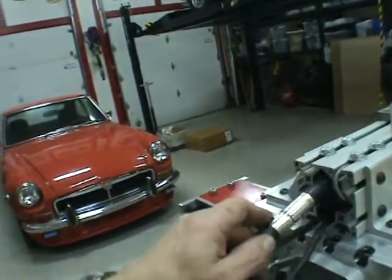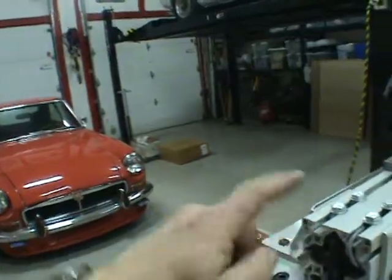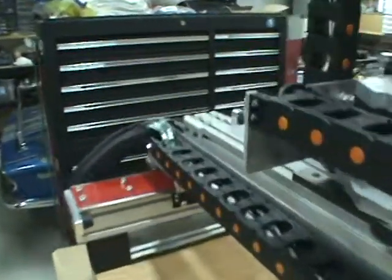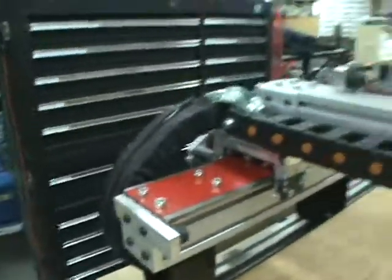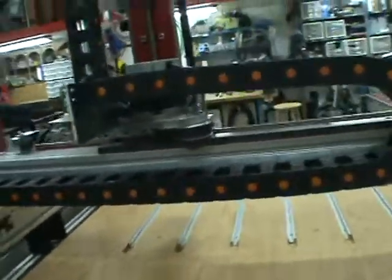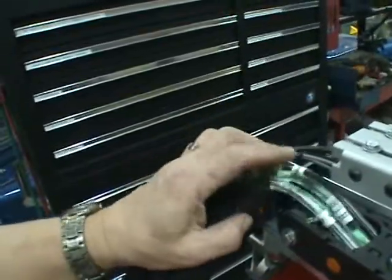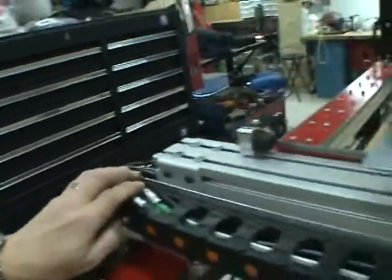For my limit switches, I mounted them on the carriage and ran through my cable trays - my e-chain. It's made it a lot simpler than having to wire the table, so I can move the table around; it's not fixed yet. You can see my tubing - everything's been labeled so I can trace them through the systems.